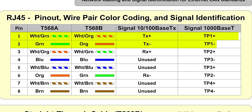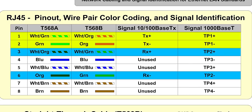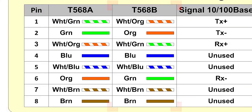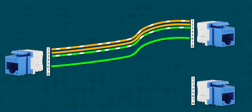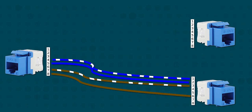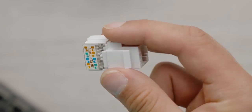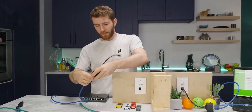That doesn't mean we're done with our janky splitters yet — if a real one could be made, then obviously a real one should be made. 100BaseT uses pins 1 and 2 to transmit and pins 3 and 6 to receive. So we wired up our A ends using just the orange and green pairs — using the T568B color coding, so orange for transmit and green for receive. Then for the B end, we used the blue pair as transmit on pins 1 and 2, and the brown pair as receive on pins 3 and 6. On the combined end, we just followed the T568B coding. As long as you're not mixing a transmit and a receive pin onto the same twisted pair, you should be okay. You also want to pay special attention to the labeling on whatever keystones you use — you cannot assume that the connectors will be in numerical order.